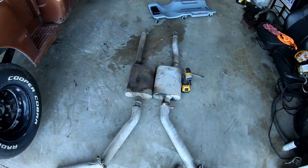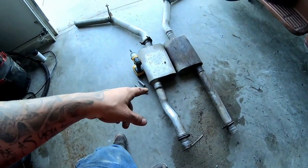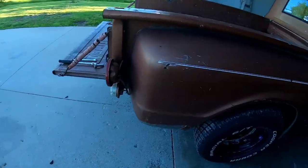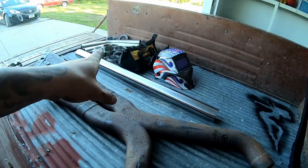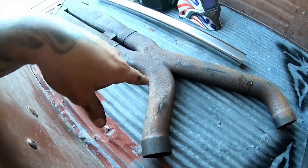And just like that, there's the exhaust. So nothing real special here, just 2.5 inch to those, 3 inch out. That's going to change because the collectors are 3.5 inch. I got 3 inch, and then I got adapters up to that. So it'll go 3 inch from the headers to this, adapt up, and then it'll go out. So is that way too much for the engine that's in here? Definitely. It'll be fine. So we're gonna run it and see how it sounds.